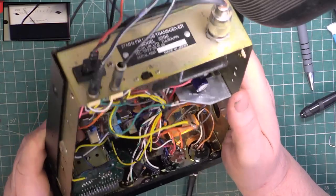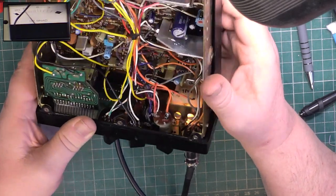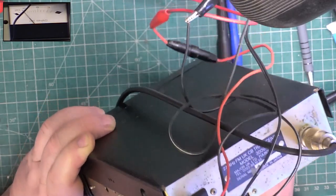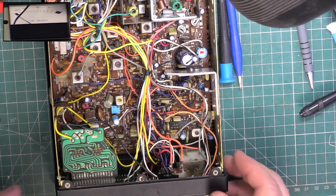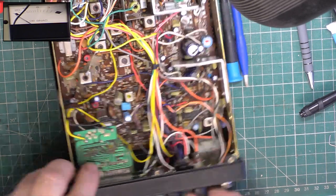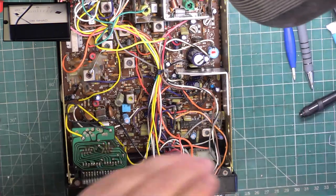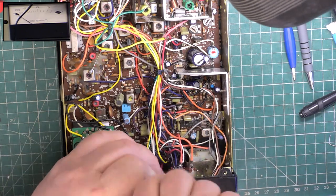There'd be an orange wire cut off from that PA switch. And the soldering is not good. Just like it isn't on the volume control. So I think before we start chasing faults, this is going to have to be addressed. So I'm just going to have to take the front off, aren't we? This will probably end up on Mr. Chippy's bench. He has about a 3-day turnaround when they end up on his bench. So it does delay them.